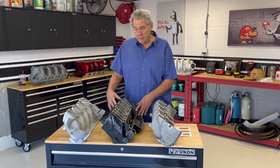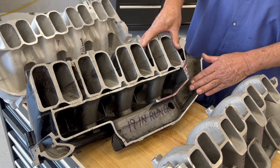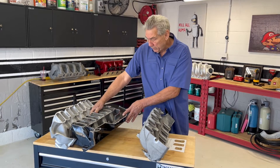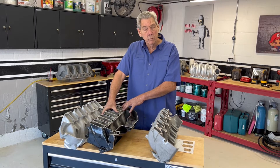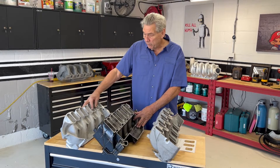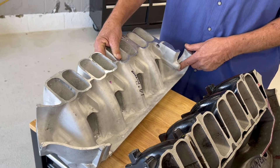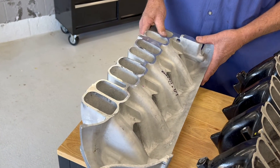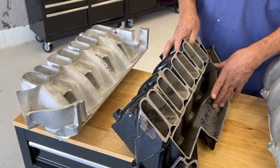So we're going to start with the stock GM manifold — that's this guy here. This has been the mainstay for the last 20 years because it was the only manifold we had to work with. When you cut the bottom out of here and remove this section, it makes an inexpensive modified intake manifold that will work really good. If you want to get maximum power, you go for a bigger cross-section runner and a shorter runner so that you can tune the power where you want it to be. We cast up a higher volume, shorter runner length, higher volume intake manifold for the 8.1 engine because this manifold is simply limited to RPM because of the long intake runners.